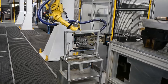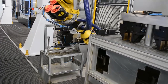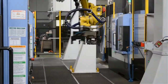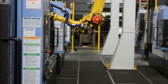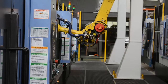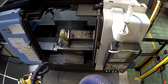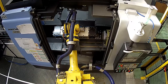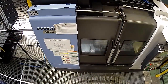In this case, we can see there is a requirement to change the orientation of the body. It is held in a fixture and the robot takes the body again from the other side. Here we can see the same process but with a video taken from the robot itself. Apart from the machining centres, the robot also delivers valve bodies to the honing machine, to the high-pressure washing machine, and to the 3D coordinate measuring machine for inspection.